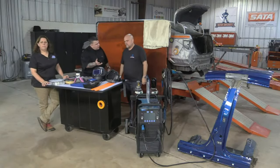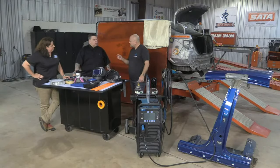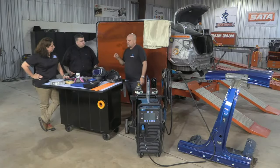But you had slot welds, which you filled in on one side or filled in the whole thing. What's the difference with Honda now? A couple of things. Honda doesn't use the traditional slot weld, which is about an inch long. There's actually a tool they sell that can punch the hole. What Honda has historically recommended is side-by-side plug welds and then a zigzag. It's not a figure eight; it's two plug weld holes together, with just a little area of steel in between.